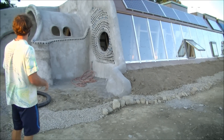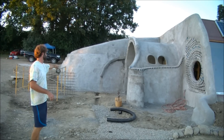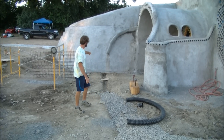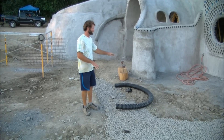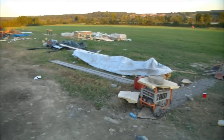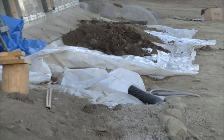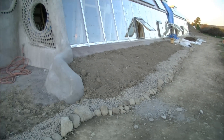Because of the design of the front entrance there's going to be some runoff from the vault, which will fall down there. So we're putting in a drain there, and then probably flagstone which will be angled away from the house — all angled towards the middle to capture any surface water on what will be a patio area, and then that shoots out that way to get it away from the house. We're also tying in the front drain because there's plastic coming off of the metal flashing. That'll capture any water off the front glass because there'll be quite a bit of runoff coming from there, and that's tied in here as well.